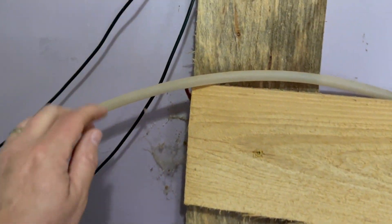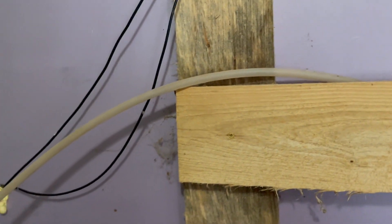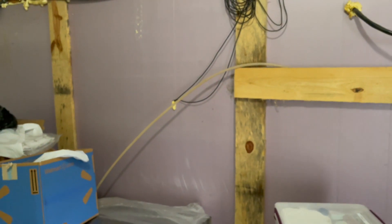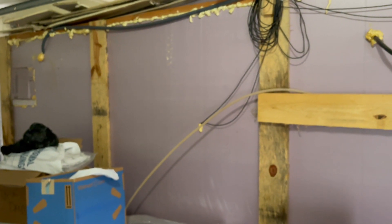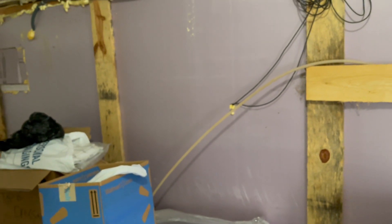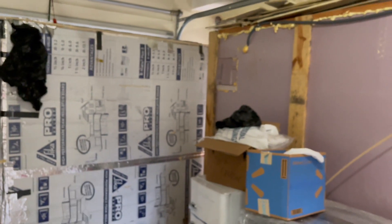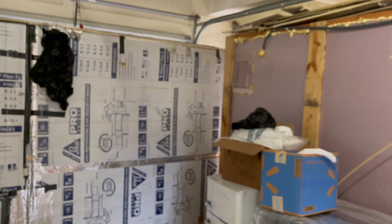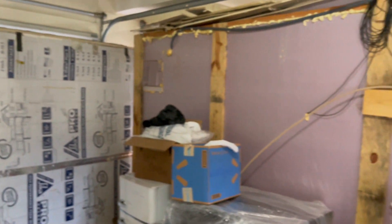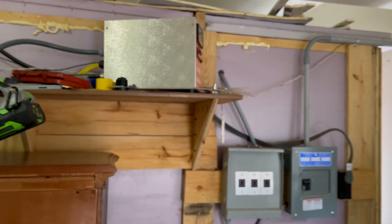Those are the sensors for the wet bulb and the dry bulb. This hose here is connected on the other side to the compressor — it runs out the garage. It's up here right now because it was below 30 degrees earlier, and since there was no running water in it I didn't want it to freeze outside. When we're sterilizing I just pull the drainage hose up so nobody drives over it, but that drainage hose runs out the garage and drains the water that comes out of the wood.